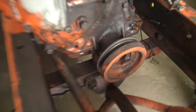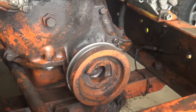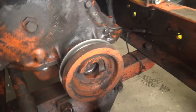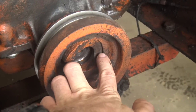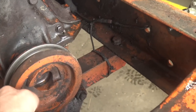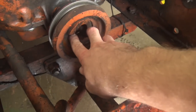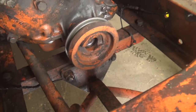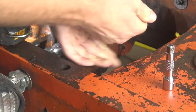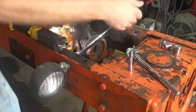I'm looking at this trying to figure out exactly what needs to happen, and I think the first thing we have to do is get this pulley off of here. I look down that center section and I don't see anything that looks removable, so I think we have to remove it by removing that bolt and then fitting a puller on here. Fun fact — see that design on the front right here? This is actually for a hand crank, if a person ever needed to crank-start the tractor. The crank goes in here; there are pegs that go each way, and you just pull up on the crank to spin the engine. Not something you see on modern equipment, which I'm very thankful for. That bolt probably hasn't moved in many decades. Just got to keep going until we break something, I guess.